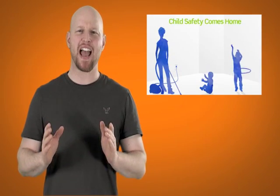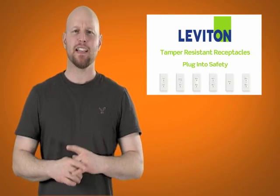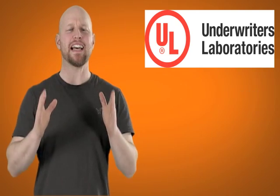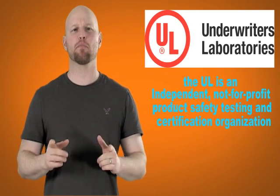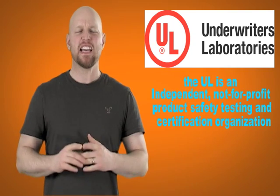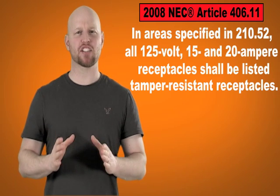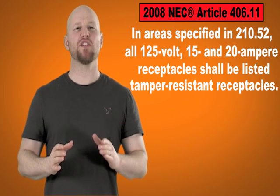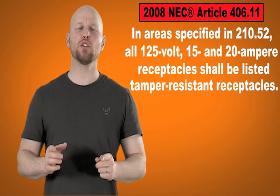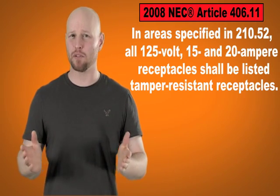As a result of this feature, TR receptacles are excellent devices that effectively eliminate potential electric shock hazards in your home. TR receptacles are the only tested, approved and listed tamper resistant device by the Underwriters Laboratory. At the first of this year most municipalities adopted the 2008 National Electrical Code, which via article 406.11 requires new and renovated dwellings to have tamper resistant or TR receptacles installed.